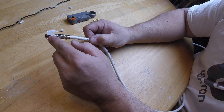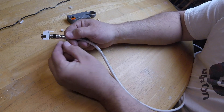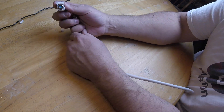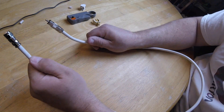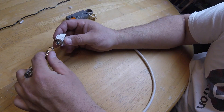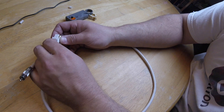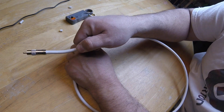I like to put threads in the back for sure, and I also like to have threads in the front. The reason I like threads in the back is because I don't want the connection to come loose. So I put it in, and when I'm looking at my plate it looks just like the beginning of the video. Then I take a new wire — I can make a patch cable with an F-connector on one side and an RCA on the other. I plug it into the front of my keystone, screw it on, and I know it's never going to come loose. That's a nice, tight connection, and this side is my RCA that plugs into my subwoofer.